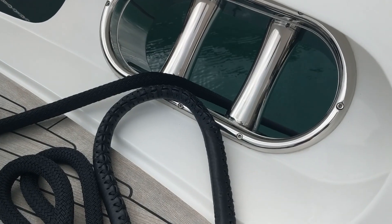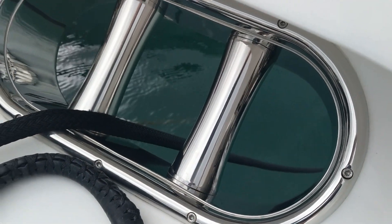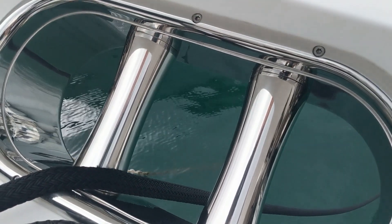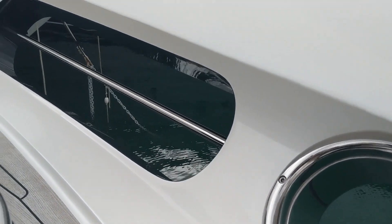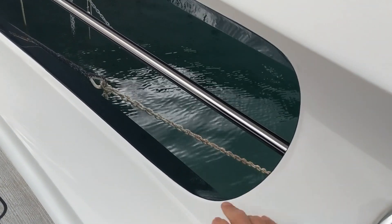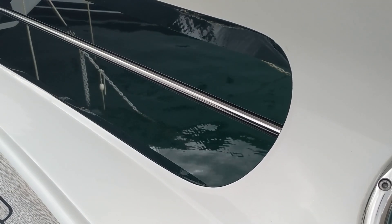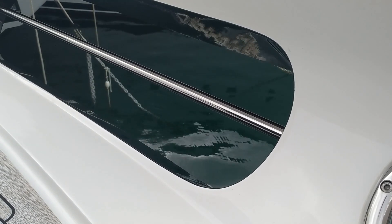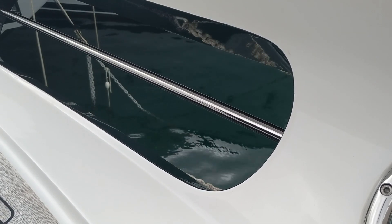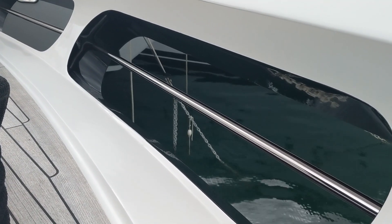Now that the heaving line has been prepared, we need to connect it to the mooring line. I would like to run this mooring line out of this fairlead — you'll notice it has two rollers on it, therefore it's a roller fairlead. Fairleads are not to be confused with freeing ports. Freeing ports are designed to quickly shed water in the event that the deck were to become flooded. Lots of water being trapped up on deck is not good for the stability of the yacht. They serve a second purpose, which is to allow us to see what is going on down at the waterline. However, this is not their primary purpose, and they are not — as I once heard — called viewing ports.